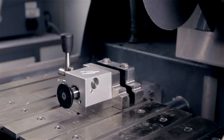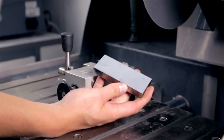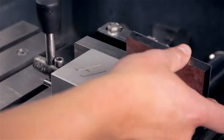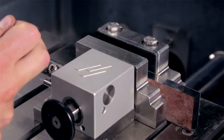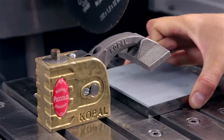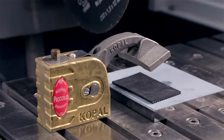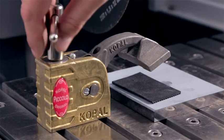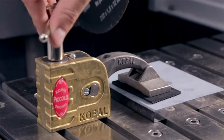With the quick clamping system, I will protect the coating with rubber inserts, and then clamp it in a direction which enables me to cut the coating before cutting the substrate. With the vertical clamping system, I will follow a similar process — first protecting the coating with rubber pads, and then clamping it in a direction which enables me to cut the coating before cutting the substrate.